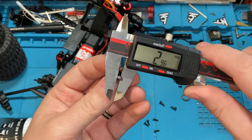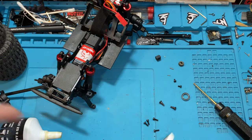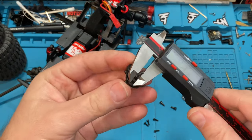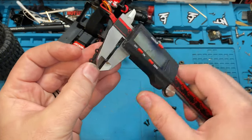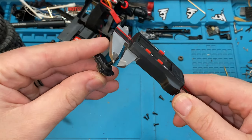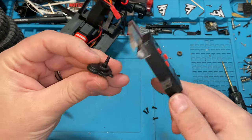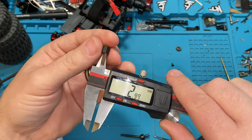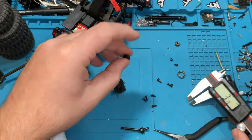The actual axle shaft is 3 millimeters. The shaft here is also 3 millimeters. And then, where did it go? Here we go. Just so you guys know, at the pin, that guy is 3.5, and at the threading, 3.4, or 2.4, excuse me. Then it steps up to almost 3, and then it steps up again where the pin goes through to almost 3.5. So your hexes are going to be basically 3 millimeter